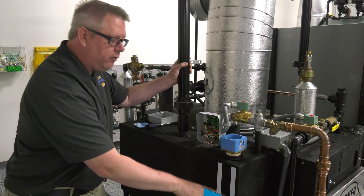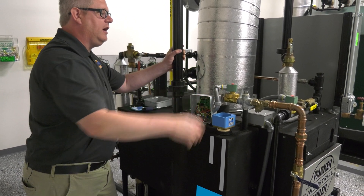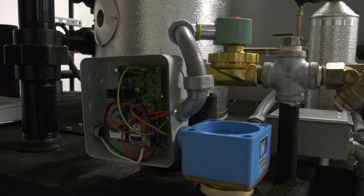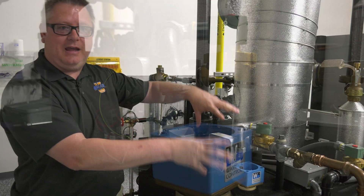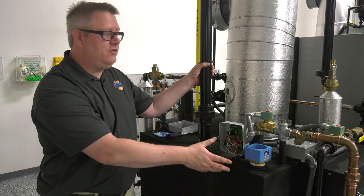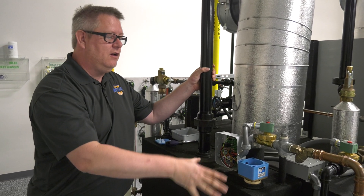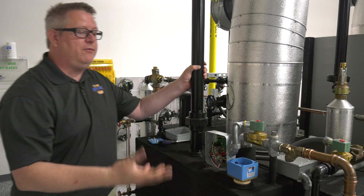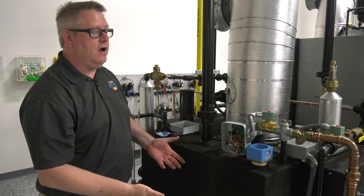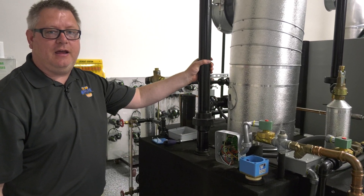When the water falls and comes off the bottom of the two probes, it re-energizes the relay. This is quite simple and not hard to troubleshoot. All connections are through the top of the tank, so there's no flange deterioration and it's easy to retrofit. The downside is it's on-off - where a trough valve modulates flow, this is all or nothing. So we sometimes encounter the tank cooling when fresh water makes up, and a lot of times we'll use preheat to help maintain a steady tank temperature.